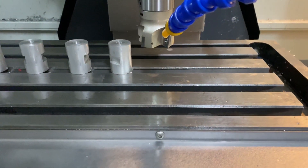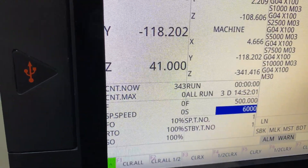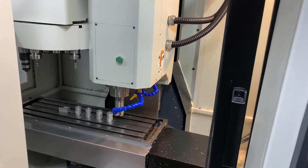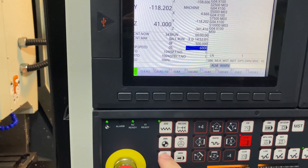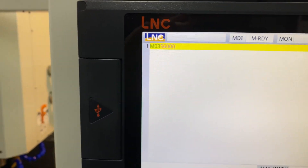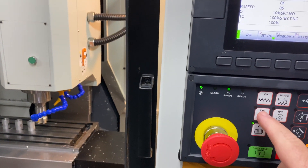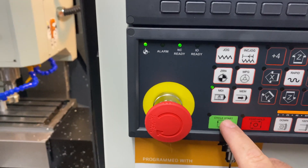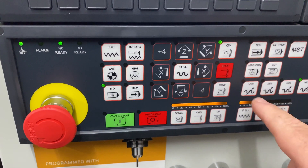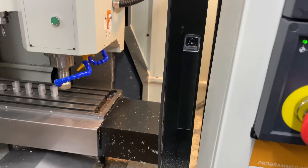You can see that I've set the spindle nose down on the table, set my relative position to zero and then went up positive 41mm. I'm going to run this CNC machine as a manual milling machine at the moment by going into MDI — you can see I've turned the spindle on with the command M03 clockwise, S 6000 RPM. I've turned down my jogging feeds right down to 20%, so I can manually jog that table across. And there we go — all those standoffs are the correct height now.